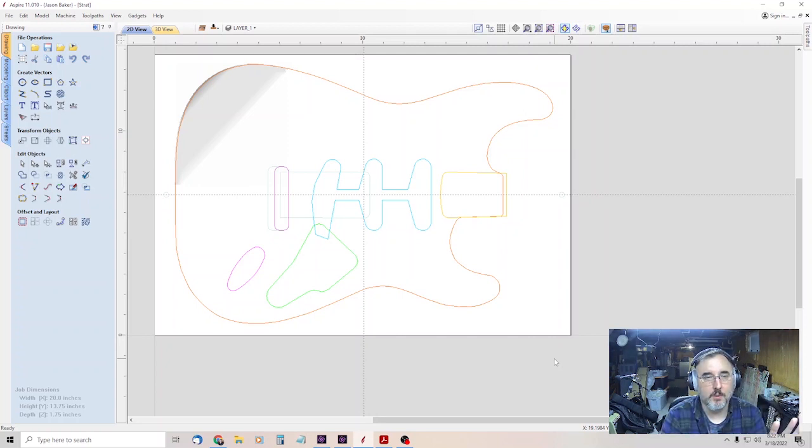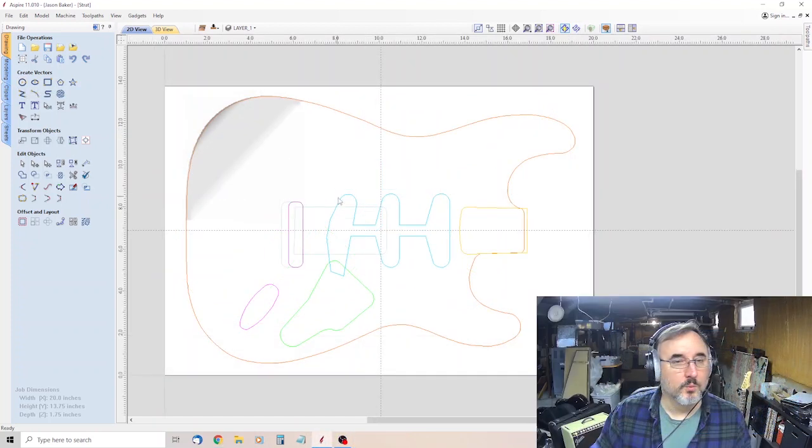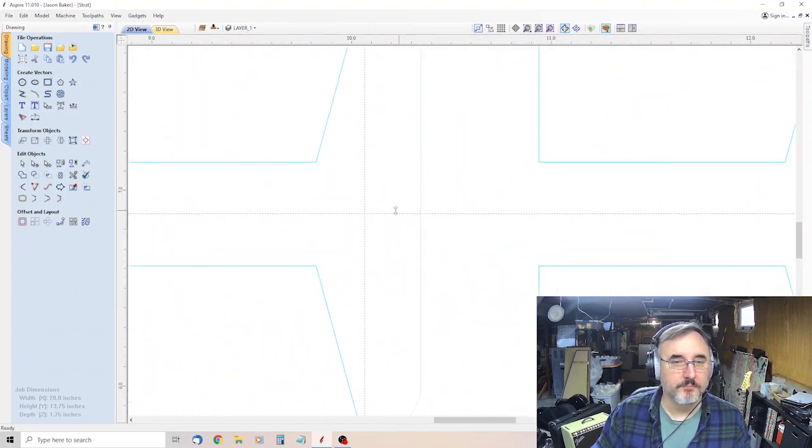But anyway, that's how it was recommended to me to do the pinholes. I did it. It worked. And so the rest of this tutorial is going to be explaining how to set that up, and then how to continue on with this updated neck pocket. And then we're going to go right on into cutting everything out. So I eliminated my guide holes, and we're going to recreate them, and we're going to put one right in the center.